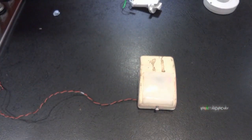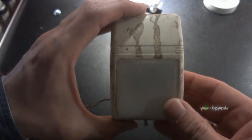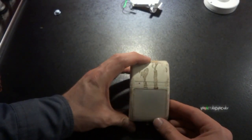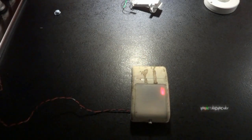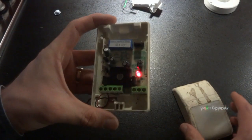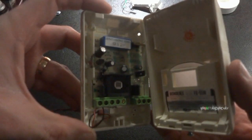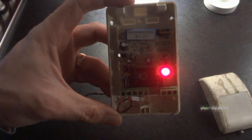Let's turn the lights down a bit. As a long-range detector, with that size lens, probably about 20 to 25 meters. So if I move my hand across the front of it - there we go. This one is also susceptible to spiders, so a good idea when you put these up is to seal all the holes so spiders can't get inside. Because if a spider approaches the pyroelectric detector, this is going to go 'oh my God, that's massive!' and activate, giving you a false alarm.